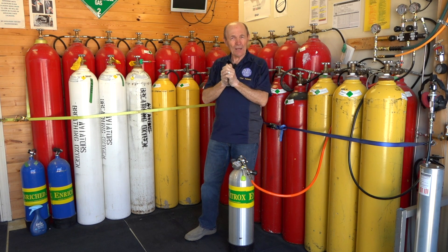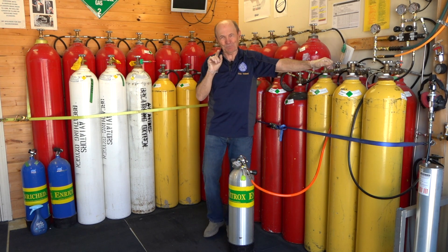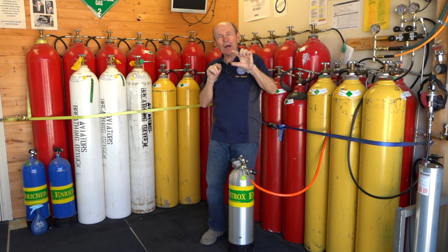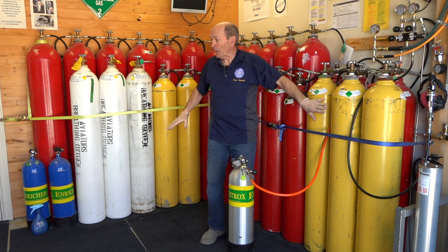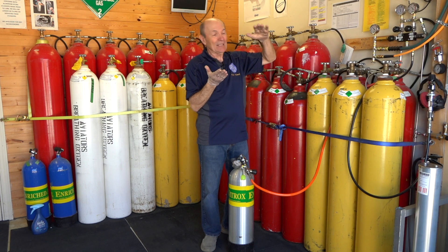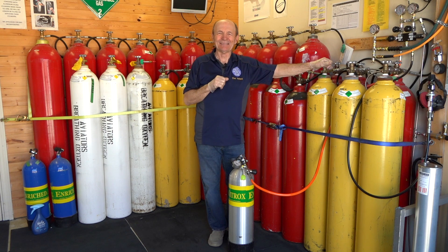I open the store at 10 o'clock. You come in, your buddy comes in, that instructor comes in - you've got a bunch of tanks to fill. I hook your tanks up to the whips and I start with the low-pressure bank - not the high-pressure bank. I open them up and fill them all to 2,400 PSI. Because there's so much volume in the big bank, it barely drops - maybe to 2,395. Then I shut that bank off, open the high-pressure bank, and top them all up to 3,000 PSI. I only had to put in 600 PSI of air out of the high-pressure bank, not 3,000. So those drop from 4,000 down to only about 3,500. All those tanks are filled.